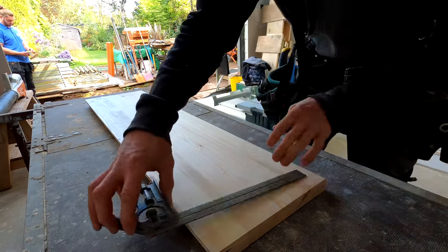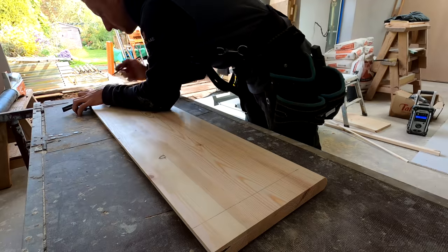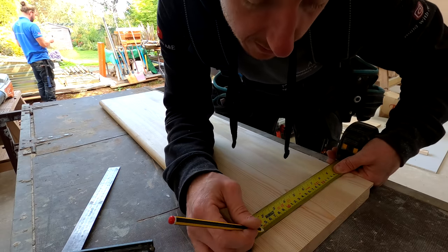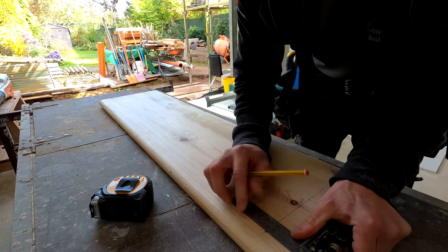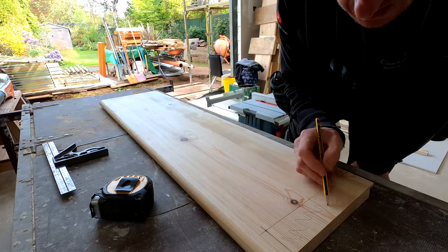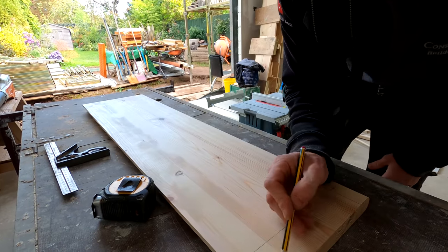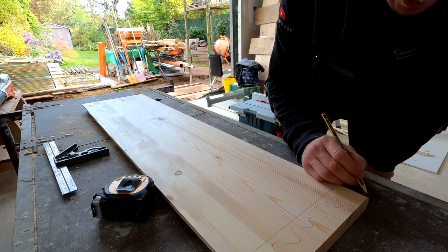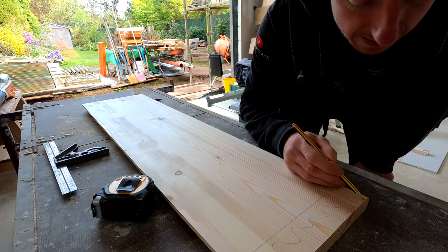All I need to do now is mark out where my horns are going to be — they're 50mm back — so we're going to go like that, nice square line, and then the same line on this side. We know we've got a 30mm overhang and then we want to sink it into the plasterboard slightly as well, so we're going to go 35mm here and 35mm there as well. We're going to remove this piece so the sill just slides in and sits up against the brickwork. Then the nose will carry on past over the plasterboard, and when it's all plastered in it'll have a nice little nose on there. I'll also put a bullnose around on this little piece here — I'm going to do that before I trim this off so I get a nice edge.